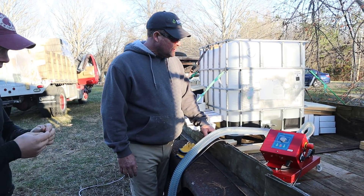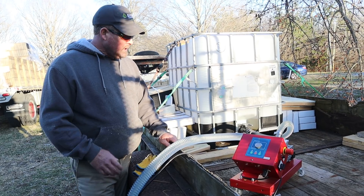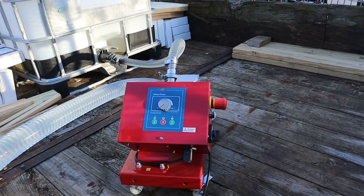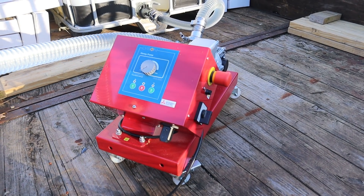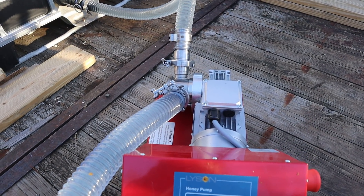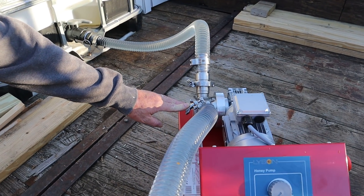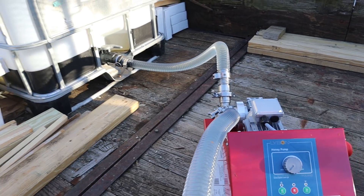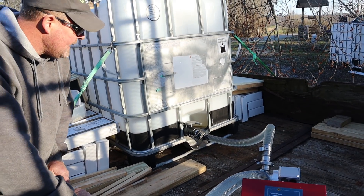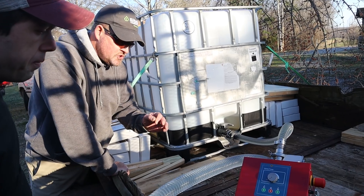What's unique about this pump is that it's able to pump a really viscous fluid like honey or syrup. Some sideliners and commercial guys use a trash pump or sump pump for syrup feeding, but that unit probably won't handle this situation — I don't think a trash pump can move this thick of a syrup without doing some damage; it'd probably burn the pump up. Most of this pump is stainless steel construction, and the pump is gear-driven so there are no belts.